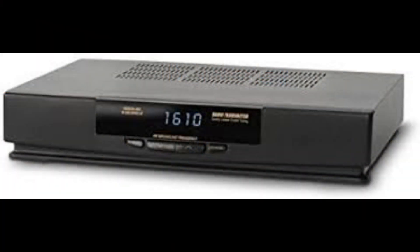But there are a ton of other ones. The most inexpensive way to get into AM Part 15 broadcasting is to pick up one of these — it's called a Talking House. These things have been around forever; I think they're on their fifth or sixth revision now. They're Part 15 legal, and with a little bit of tinkering — hook up a longer antenna, do a little bit of tuning — and you've got yourself an AM station that can conservatively work a mile. Some people can easily get two miles. My station here gets about a mile and a half to two miles, depending on which side of the house. You could probably pull my signal in at three miles out, which is just incredible for one-tenth of a watt.